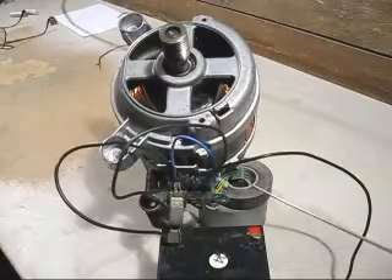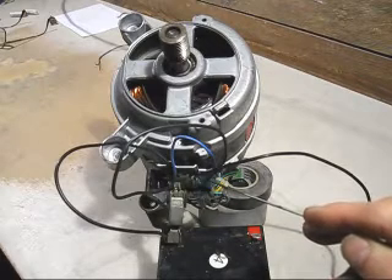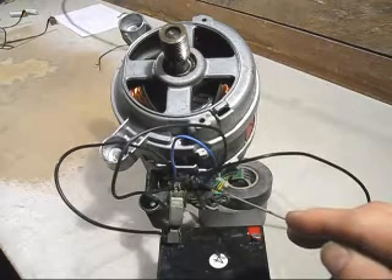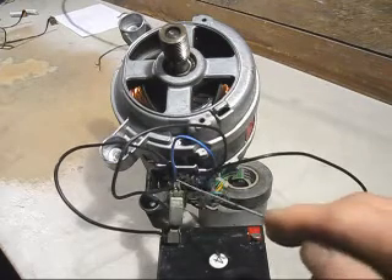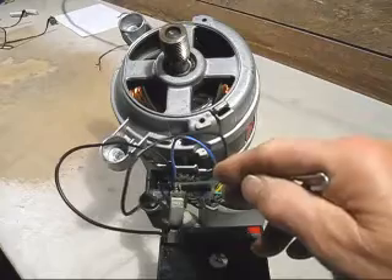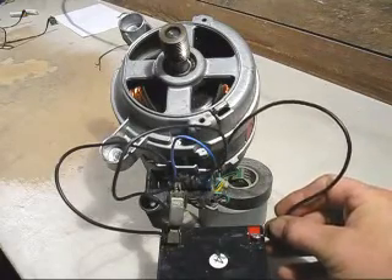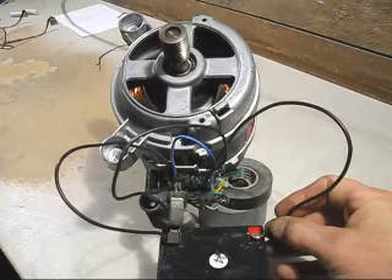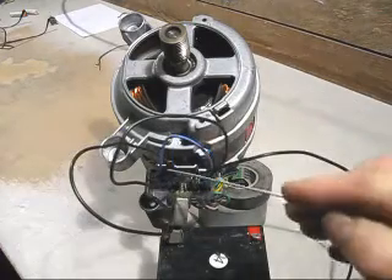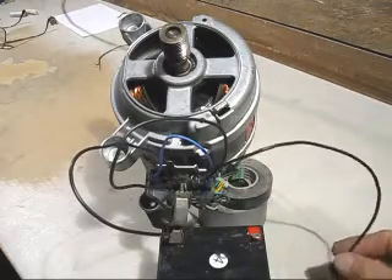Here's how I've connected it up. This is the first wire — the in wire going to the battery — and that's the out, coming from that one field coil. We've got two connections in one, so I've put it in here. We'll see what happens, then connect it to the second connection and see what happens. The motor is turning anti-clockwise at a certain speed. Now I've put the blue jumper wire to the second connection on that field coil — we'll connect the battery and see what happens.